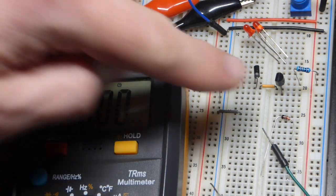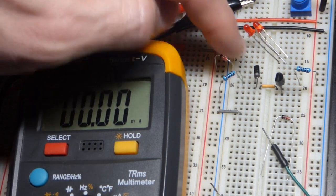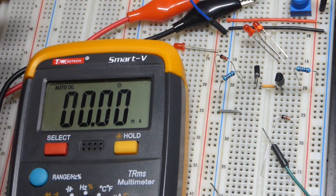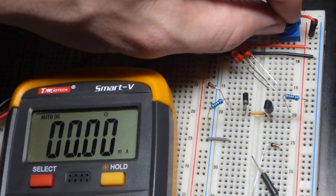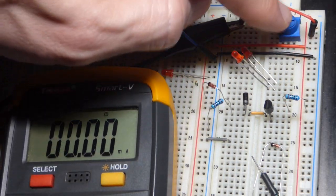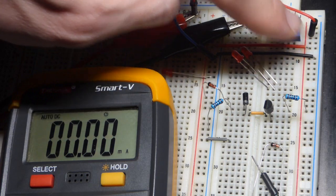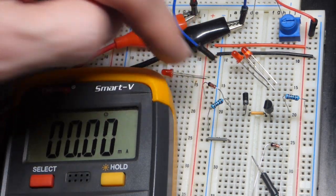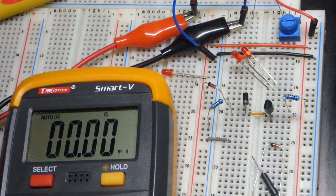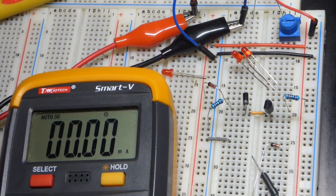So we can control the current under varying loads. With the power supply voltage changing, the Zener voltage will adapt — it's going to hold steady, as will the rectifier diode, even as the power supply voltage changes. A few videos ago I used a trim pot; the trim pot depends on the rail voltage and position, so as the rail voltage changes the output changes. You don't have that problem with a Zener — other than a small amount of voltage change due to differing current through it, it holds pretty true. You can pretty much rely on that voltage even with the rail voltage changing. Hope that all made sense. Hope you enjoyed the video. Thanks for watching — I'll see you in the next video.